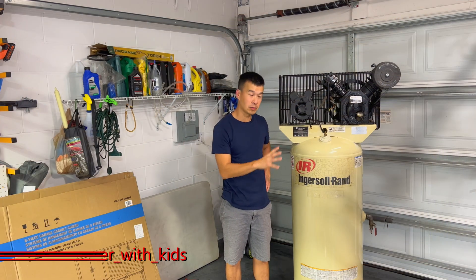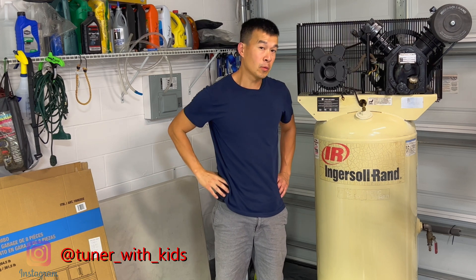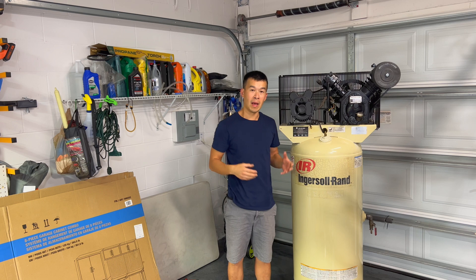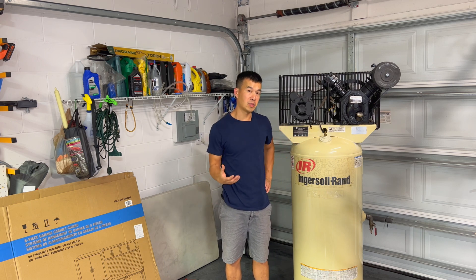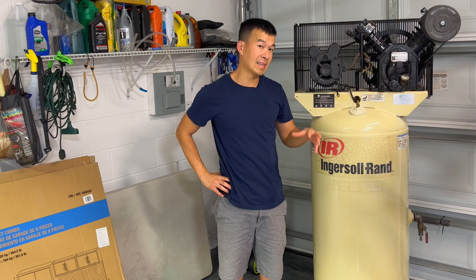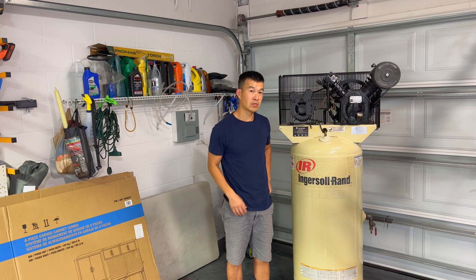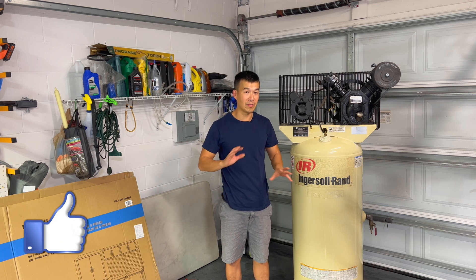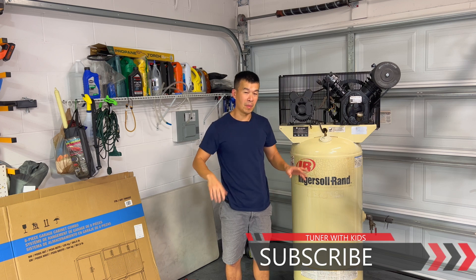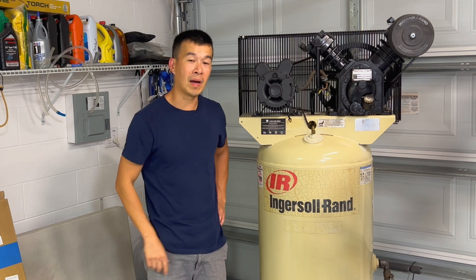Thanks for joining me on this quick video on how to do hydrostatic testing on a tank. As you can see it's a pretty straightforward process using a pressure cleaner. Other people use different methods — there's a method using a grease gun where you pump it into the fitting to build the same pressure, and plumbers have a special hand pump tool they use to test lines. For my case, since I didn't have either of those tools, the pressure cleaner was the next best thing — readily available and easy to use. If you found this video useful give it a thumbs up, and if you haven't subscribed for all my DIY videos around the house, car, or garage, go ahead and subscribe. If I can do it, you guys can do it too — thanks for watching and I'll talk to you next time.